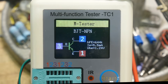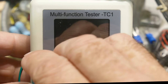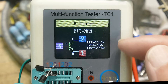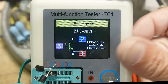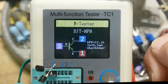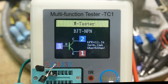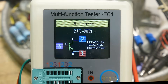Let's try the Sziklai. Again, it thinks it's an NPN transistor. This time the HFE is 11,000 — not quite as high — and we have six milliamps this time. But look at our voltage base-to-emitter: it's only 0.55 volts. I'm not sure why it's not 0.6, but it's 0.55 for that particular transistor. So remember those two numbers.